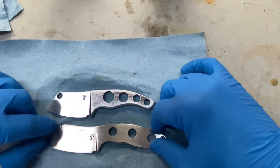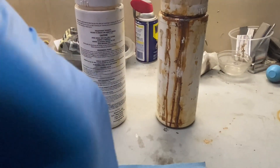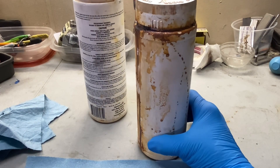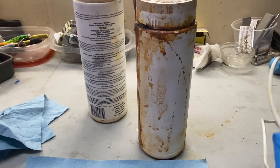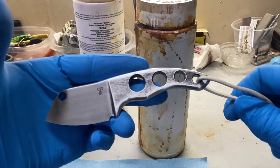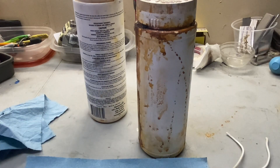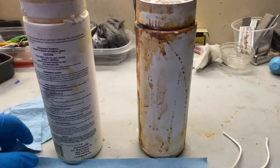We are cleaned up and prepared for etching. I have two bottles here — the ferric chloride mixture. I'm going to use some electrical cable to hang the blades because you don't want anything metal holding them, as it could affect the etching. I'll just wrap the cable around and drop the blade in. I typically do this process once or twice total.